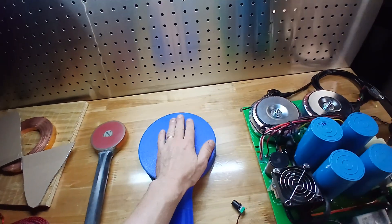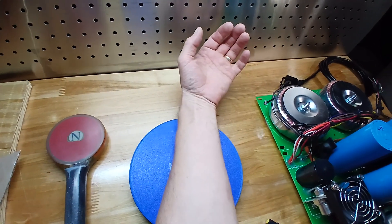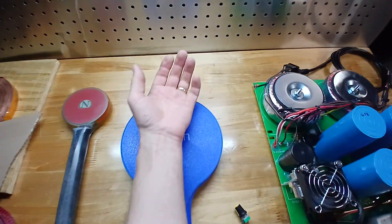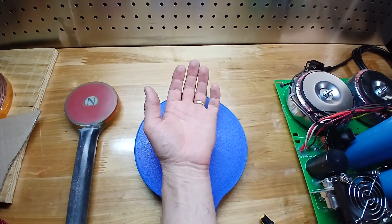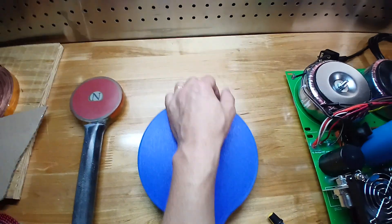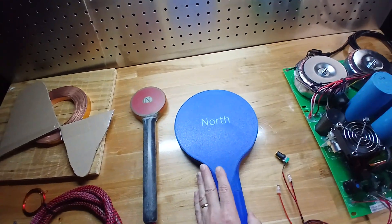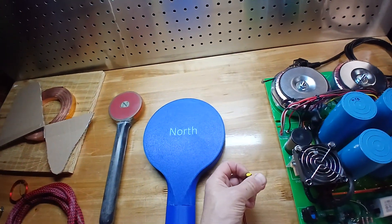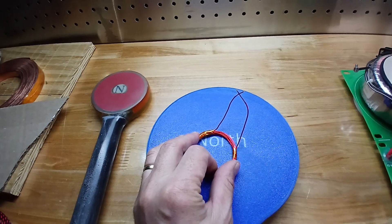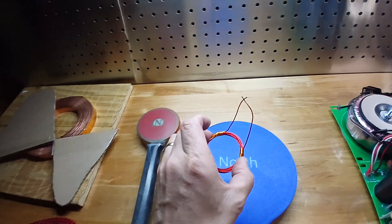This coil does trigger muscles at 0.75 Tesla. Right now it's at 0.3 Tesla — 0.3 Tesla almost doesn't trigger muscle — but as I increase the intensity, you can see my fingers twitching. Yeah, so it is strong enough to cause muscle contraction. And at the lowest setting, I can show you that it's putting out a good magnetic field at 0.3 Tesla — as you can see I can get this coil to spark.